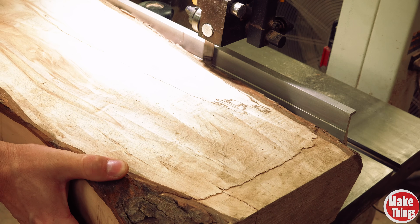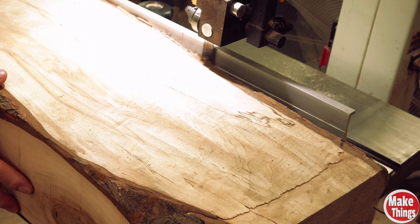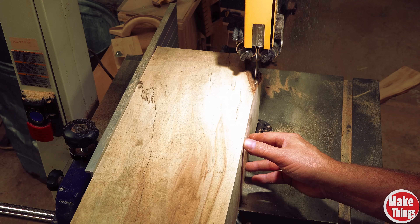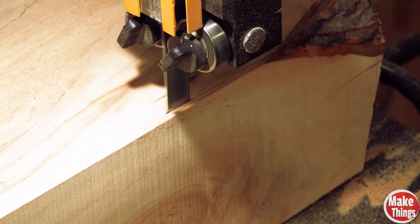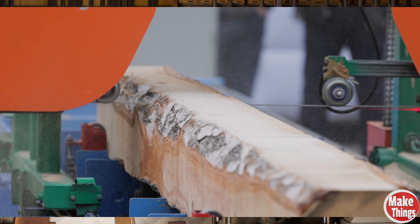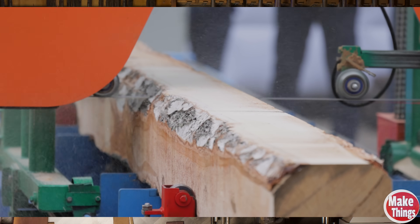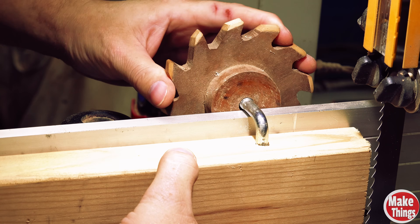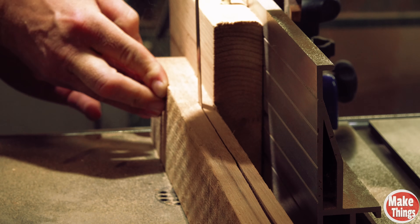If you're cutting a piece of lumber with the fence, like a table saw, half of your attention will be spent keeping the stock against that fence. This is putting a lot of stress on the blade, especially if our stock is trying to open up. But you don't have to toss out your bandsaw fence — we just need to make a few adjustments. First and foremost, if you're dividing a small section off a larger section of stock, keep the longer section or the side with the most mass against the fence. If I'm cutting bookmatched pieces, the thicker part is what I'll put against the fence. This will allow our wood to open up. A better method is to add a fence to your fence that stops in the middle of the blade. This will allow your stock to open up as it's being cut, easily allowing the energy to be released.